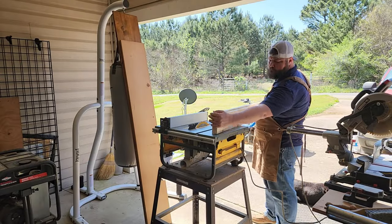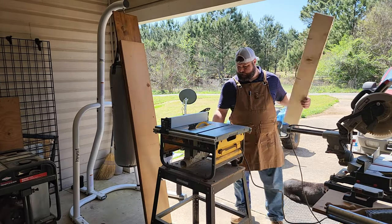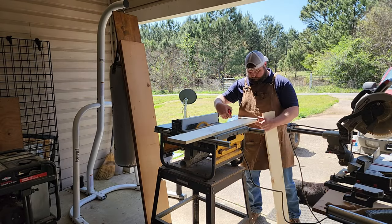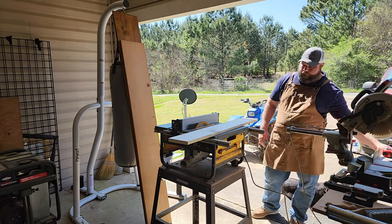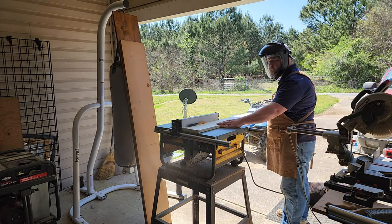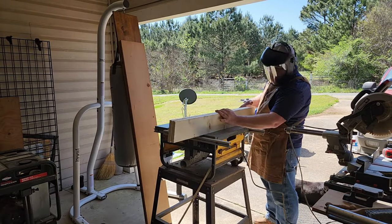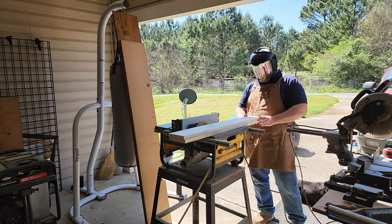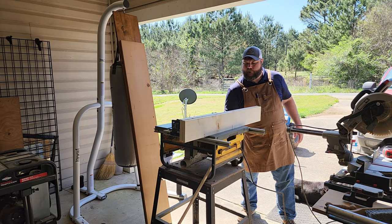Make sure you keep your hands clear of the blade. Notice I don't have the blade protector on there — you really should — but I don't because it grabs the wood. The pawls on the back help with kickback, but I stand clear so if it does kick back I can get out of the way because kickback can hurt you. I've had it happen to me once. I always wear a face shield just in case — one time I had a knot come loose and strike me in the face, and ever since I've worn the Uvex face shield for table saw work. I also use it on the lathe.